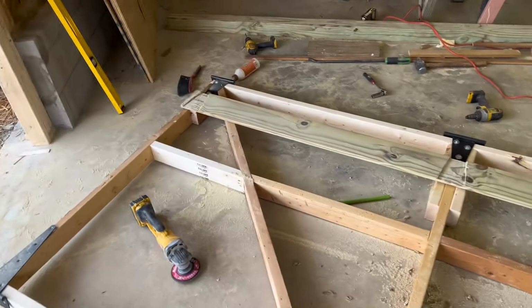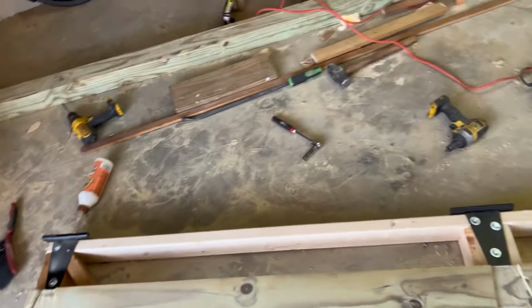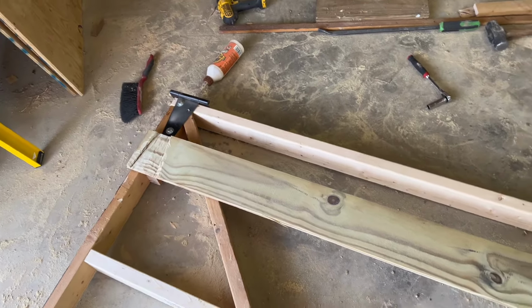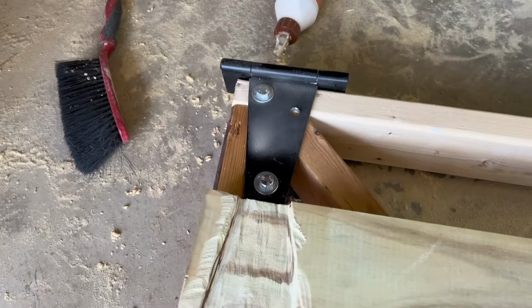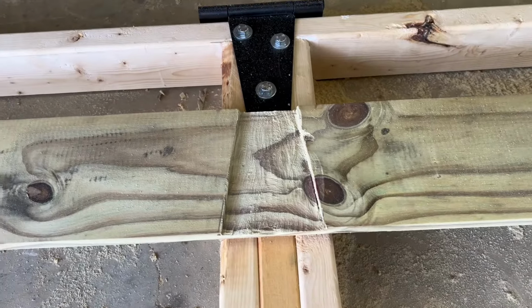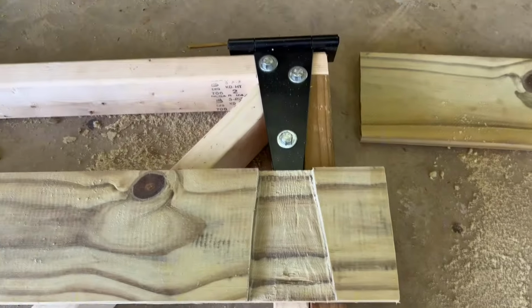Guys, so this definitely escalated a little bit. I decided that I wanted the part of the hinge on the door to be hidden. I thought it would look nice, and I've learned a lot. This was my first attempt. As you can see, pretty bad. I tried to just go with a flat disc grinder, and that looked pretty terrible. So my next strategy, I went with my circular saw and then chiseled them out, and those turned out a lot better.